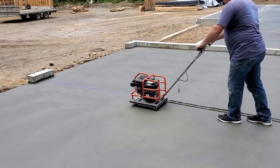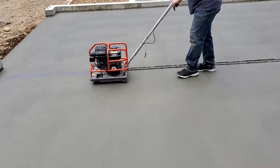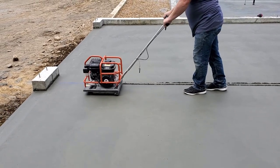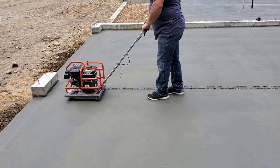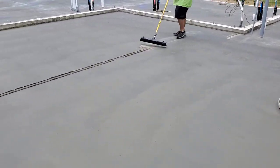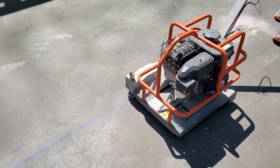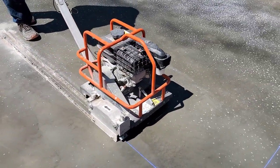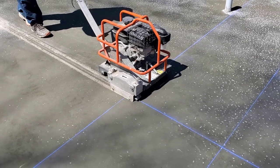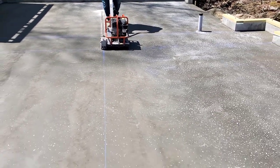It's about 12:30 and we're just finishing up the garage. I've got to edge this one more time — it's got just a little bit left — but it's hard enough to saw, so we're getting that part done. We started pouring here at 6:30 this morning, it's 12:30 now, so six hours from start to finish, and we've got this 40-foot house and garage floor all done. As you can see, we don't wait to saw it. Once we get done troweling, we're putting that saw on and cutting those joints in. That's one of the reasons why we've controlled our cracks in our floors really well. We have very minimal cracking — just occasionally you'll get one somewhere where you look at it and go, 'I have no idea why that cracked there.' But for the most part, this saw controls cracks in concrete, and that's why we got it and why we use it.